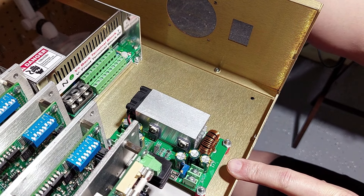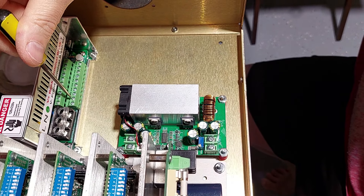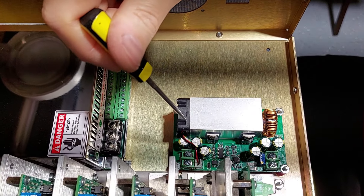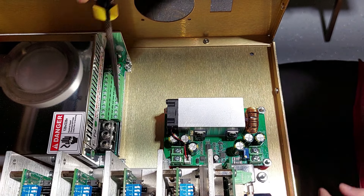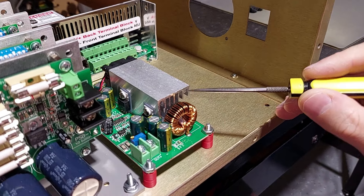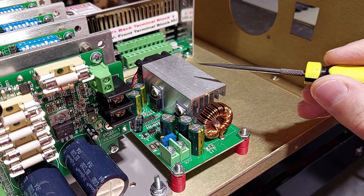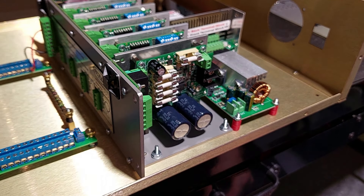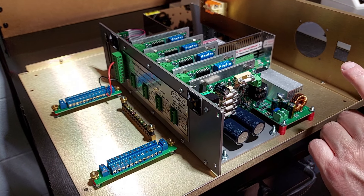You can see the lead length going from power in — V-plus in the back, V-negative in the front — and we're just going to run two leads over to convert our power to the step-down to reduce our voltage to whatever we choose. We only need 24 volts. Look at the massive heat sink on this step-down along with the active cooling with an integrated fan. Always pay close attention to the cooling of your step-down.